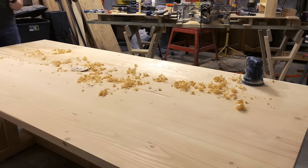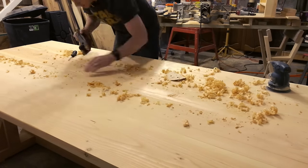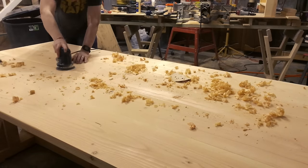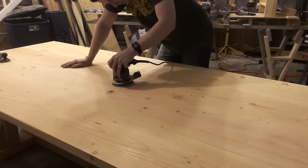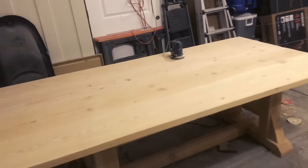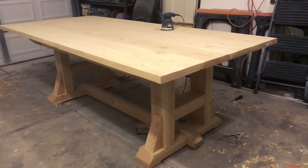Once the tabletop dried and the glue was cured, it was time to shape it. You're going to end up with some inconsistencies in the height of the wood on the surface like you see here. I used a hand plane and a sander to get as much of that work done as I could, but then I realized a lot easier way was to use a belt sander with a low grit paper. So I purchased a cheap belt sander and used 36-grit paper to do a lot of the shaping, and things moved a lot quicker at that point. Sadly, while working on this table my trusty Ryobi orbital sander that I'd had for over 16 years bit the dust and finally gave up the ghost.